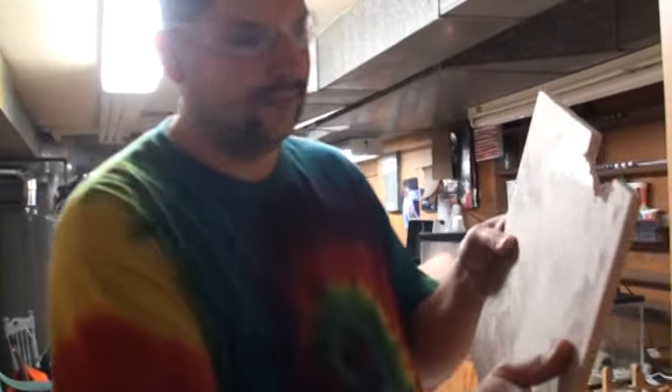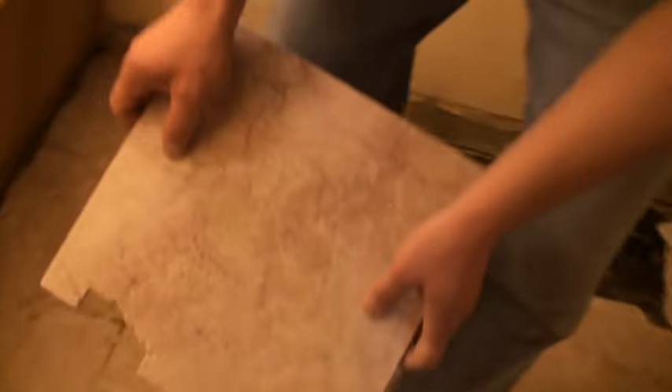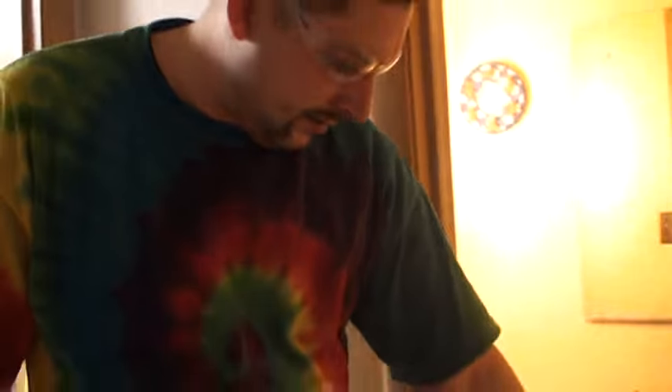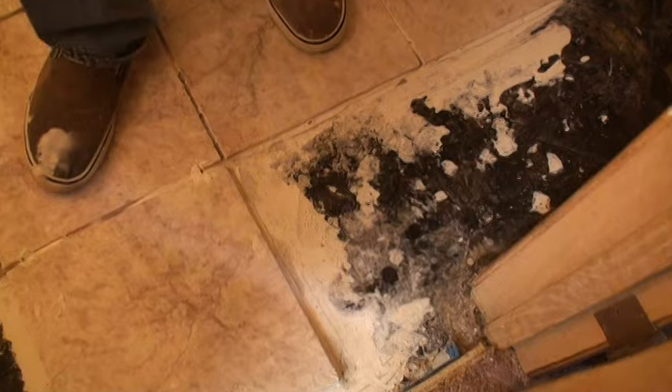You see this tile? See that space — I cut that with the tile cutter. If you look over here, it fits right over here. Right in there. Doesn't have to be a perfect cut, because the grout will fill in all the extra little cut imperfections. I did the other side too. This tile's for that side over there. I'm working on this tile next — I'm in the middle of cutting it. You want to go see me cut a tile?